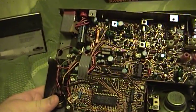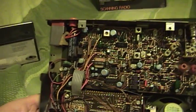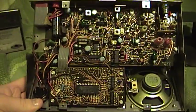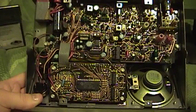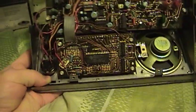Turning the radio over reveals lots of fun things going on here, where a modern radio would probably have this circuitry all condensed into one simple integrated circuit. Here you can actually get a feeling for what the signal is doing and where it's going. There are basically two boards in these radios — they are definitely an early example of electronically tuned radio technology. You have the radio board up here, which also contains some power handling components, and then down here you have the microcontroller board.